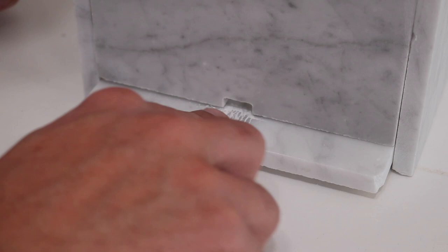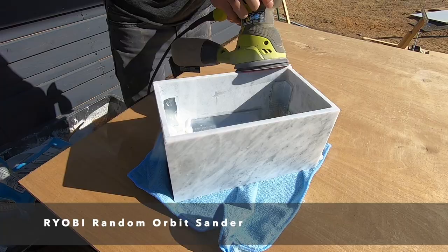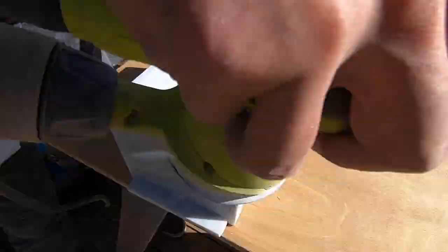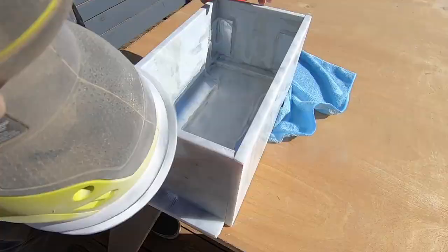The tile is pretty glossy and I prefer more of a matte or satin finish, so I just used some 220-grit sanding pads on my orbital sander and cleaned up all the glued-up edges and sanded down the broad surfaces as well, just to give it a little bit more of that soft matte finish. Marble like this is relatively soft for a stone, and one of my corners was just a little bit uneven, but I was just able to use the orbital sander to round that over and disguise it.